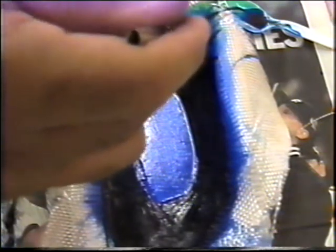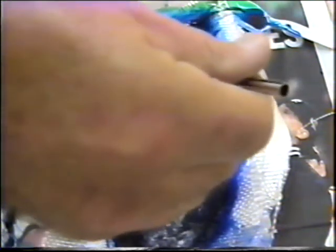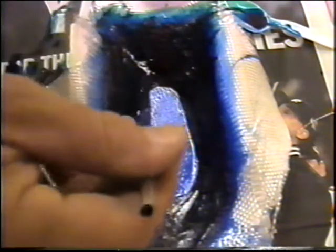Now, the carbon and the West Systems is going to be, I hope, very strong. But again, I know the strongest will be the Epon. That has to be post-cured and everything. But for right now, to get a cowling on a plane so we can start working it, I think this will be fine. This is going to be mostly carbon and e-glass with West Systems resin. And I'll put this aside to dry.